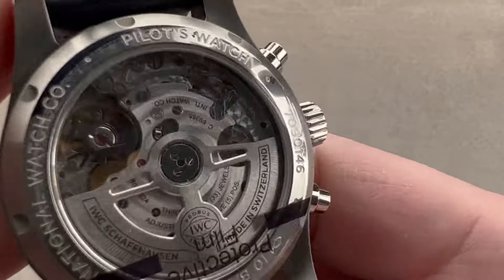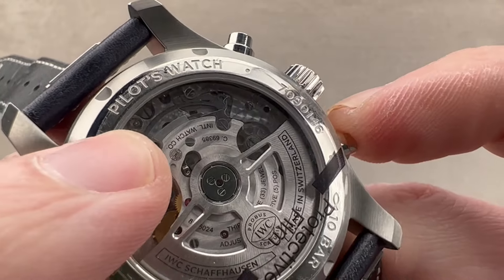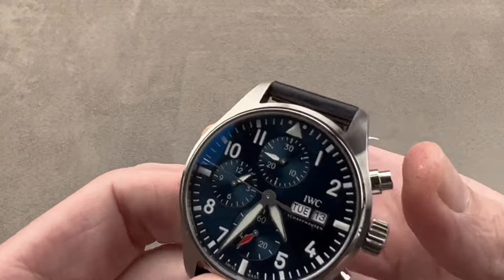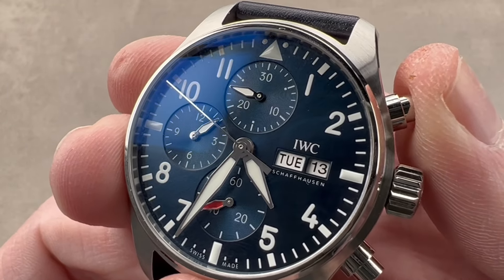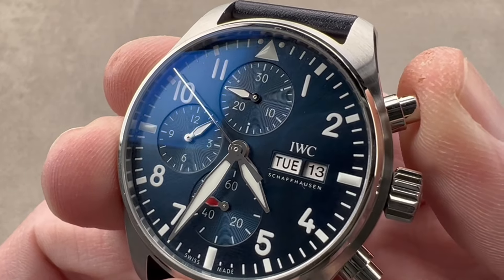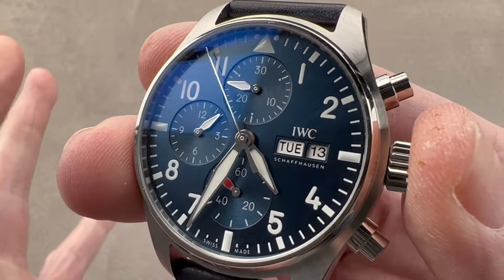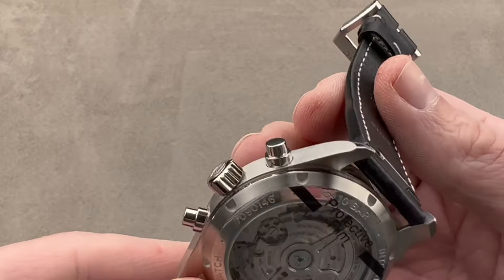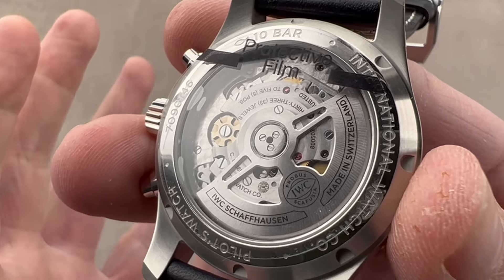One of the best features of the 7750 is retained: the use of an oscillating pinion. You can see it through this little skeletonization moving back and forth. That's a very fine-toothed lateral clutch system that often produces as little extraneous hand motion as a vertical clutch. As I press and hold, it generally just engages without additional play — a very precise way of building a lateral clutch. It's something that a lot of upscale chronograph brands like F.P. Journe use, precisely because it combines the beauty and tradition of a lateral clutch with a lot of the precision of a vertical clutch.